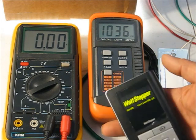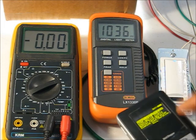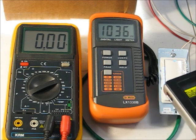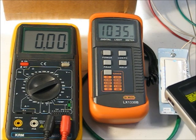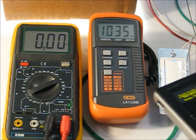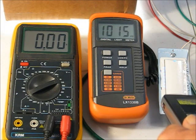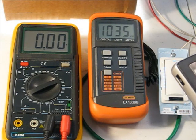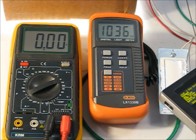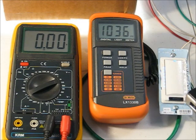So turning on our handpiece, the first question we need to ask ourselves is, when I tell the system a certain percentage, how does that relate to the control voltage coming out? Because we know we want to be somewhere a little above 7.5 and maybe somewhere a little below 1.5 volts. So there we go. We're hooked into this circuit, and we are going to set the high trim for 50%, and we'll see if we get 5 volts out of the controller, because that's a very good spot to check.